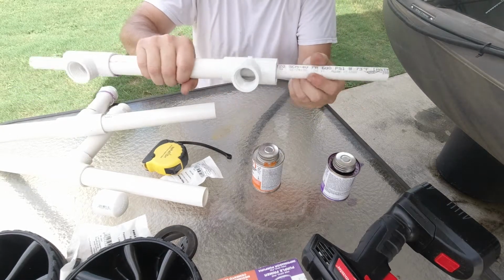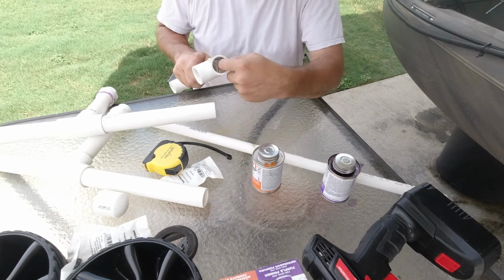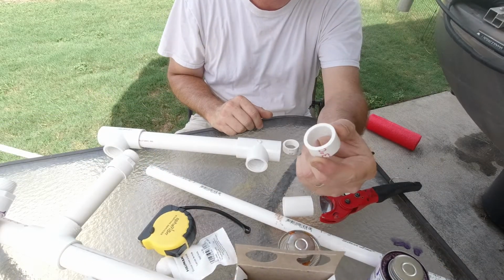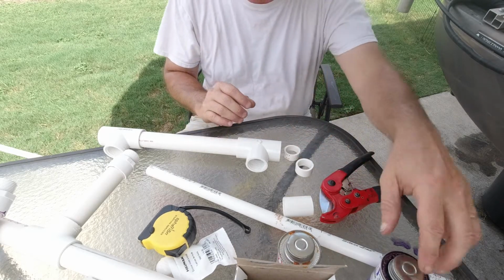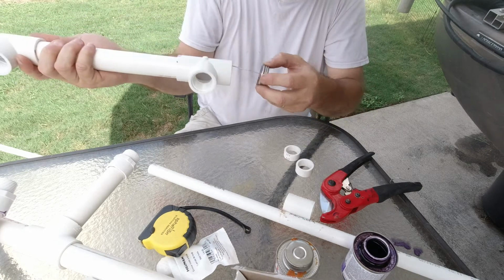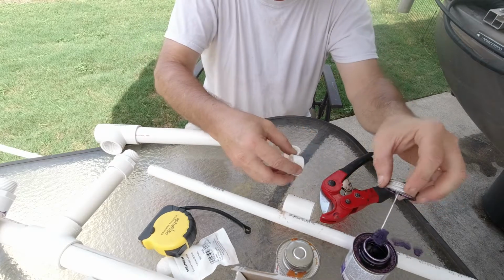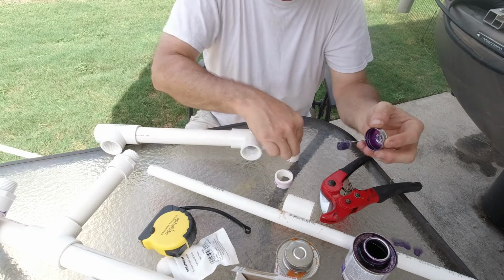And the wheels are on each side, but it's awful loose inside here, so we need to put another piece of pipe inside here that tightens this up and it creates another bushing. Okay, so what I've done is I cut some more of the PVC pipe just a little bit shorter. This one's smaller than the other one. It does not matter, just as long as it goes in and flushes pretty close. So we'll just take some more of the cleaner fluid. We'll clean both ends. I've done this before on another one. It seemed to work pretty good with this bearing style deal using PVC pipe.